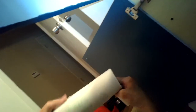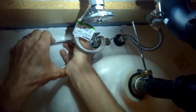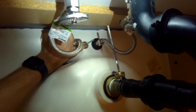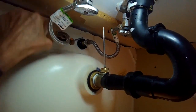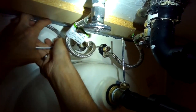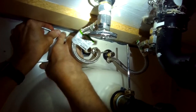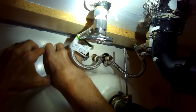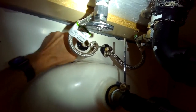Using my pliers to loosen the other one. Remember to turn the water off first. The only difficulty is there's not much room to work, so I'm just laying on my back and reaching up there — I've got a nice flashlight so I can see what I'm doing. I put a little towel underneath me so the edge of the counter doesn't push into my back. Getting those water lines off first, then grabbing the black plastic nut and going lefty loosey to loosen those up. Use the pliers first to get it started, then just use your fingers to spin them off.